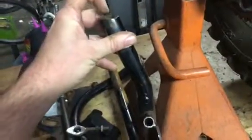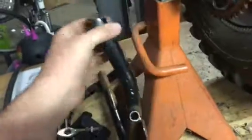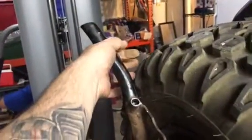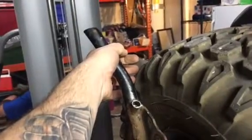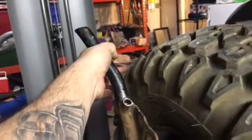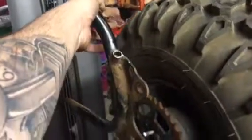The black pipe will fit inside of this pipe, so once I get all this mocked up I'll be able to slide it underneath the frame and use the black pipe as a plug between the two pipes and weld it all together so it's strong. That's where I'm at right now.